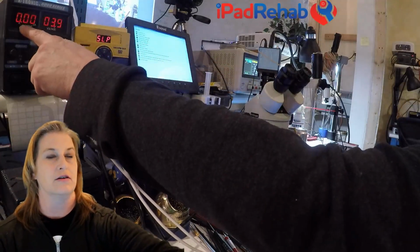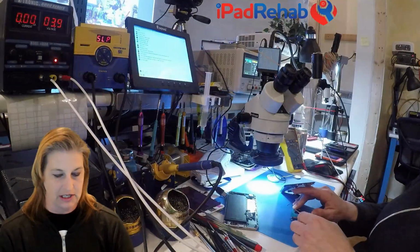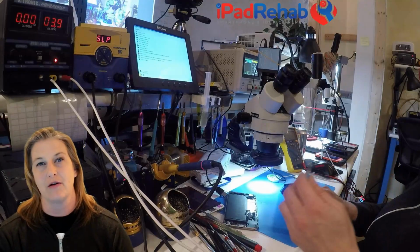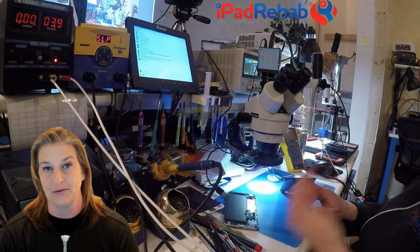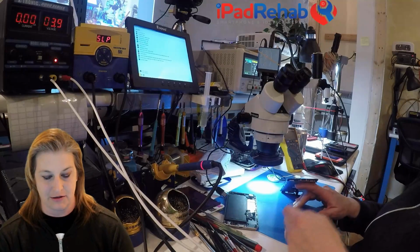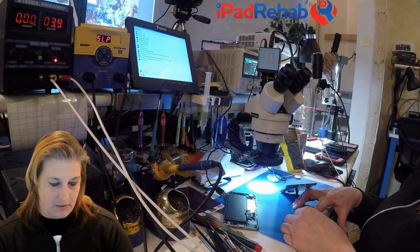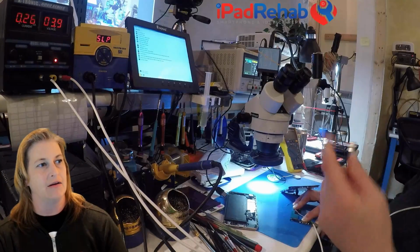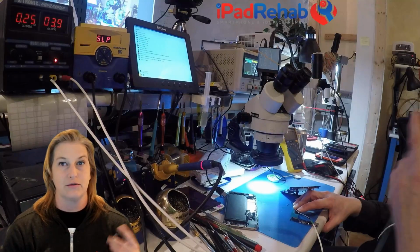This is 0 current consumption with a full battery voltage being pushed into the device. So right now we have our battery power rail, our main power rail is all filled up with blood, but nothing's happening because the phone hasn't been prompted to boot. That's normal. You don't want your phone to consume current when it's just sitting there in the off state. So now we're going to prompt it to boot. I'm going to prompt it to boot with a USB cable, and then I'm going to pull it out so that it's drawing current just from the battery connector, not through USB.